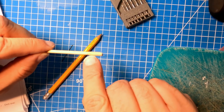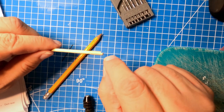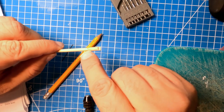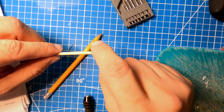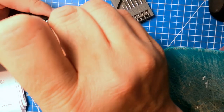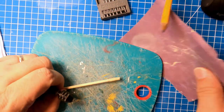So like I said, I went ahead and put some wood to make this a little bit thicker and made it octagonal. Cut my notch in the end. I'm going to use a little wood filler on it, but this is all going to get painted black from here back. So do a little wood filler and cut my sheaves in. And my sheaves that get cut in it are literally just two holes drilled.